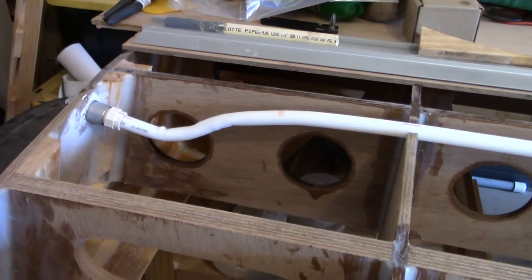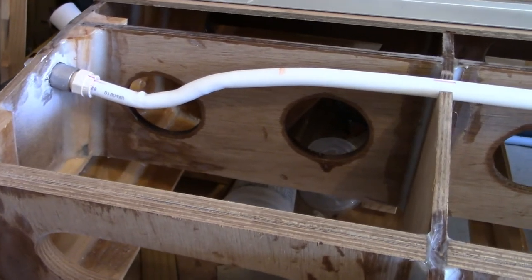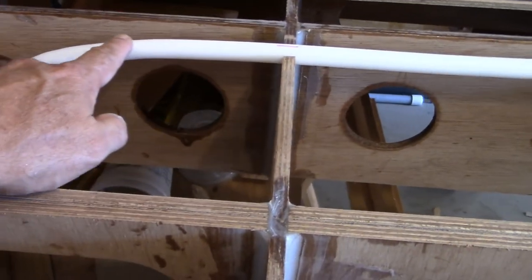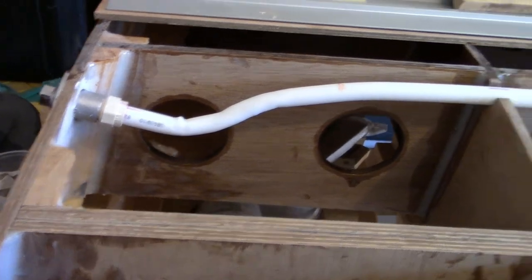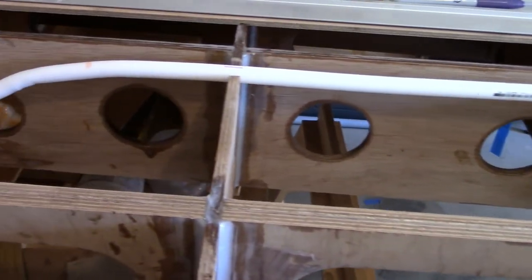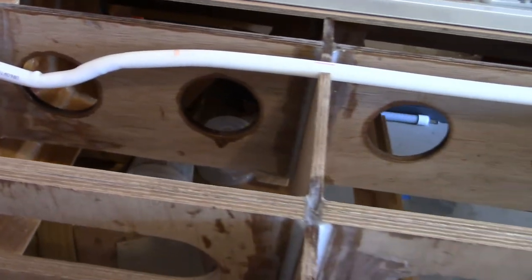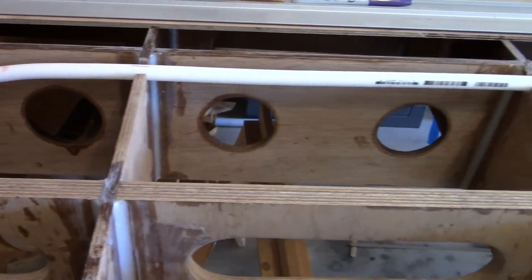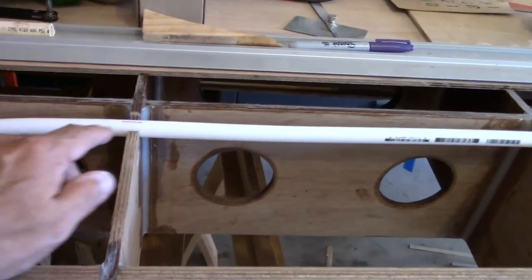Welcome back — and that is how it's going to look. There's a small kink right here but it's not going to hurt anything; that tube is still wide open, not an issue. It will end up with a low spot here, but that can't be helped just because of the angle of the transom and having to make that turn. It will get the majority of the water out of that forward compartment if it ever takes on water, and then you'd flush the tube with compressed air to get the remaining water out after a fishing trip.